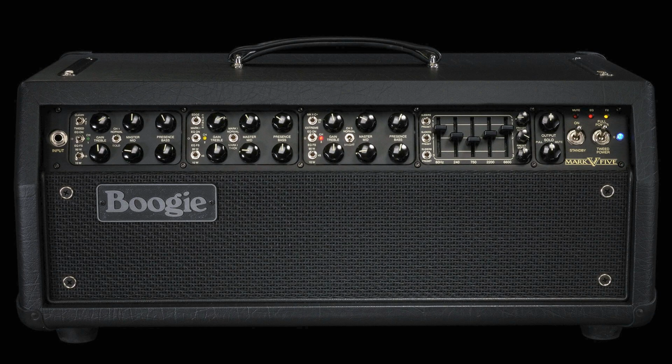Well, one of the things that I wanted to do is make sure that people didn't see it as a Mesa EQ. The whole idea was that you made a V out of it because the Mesas were so mid-range intense. That's how they got all that sustain and that honk. But you needed the EQ to take all that mid-range out once you established the mid-range gain characteristic.